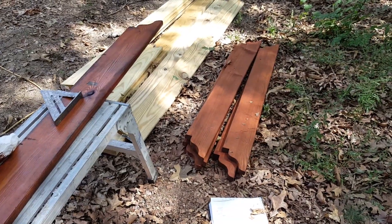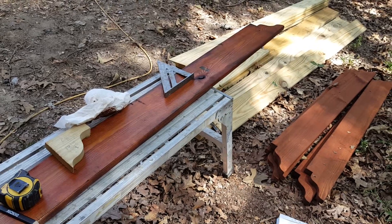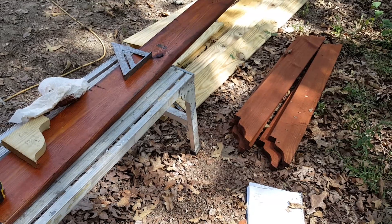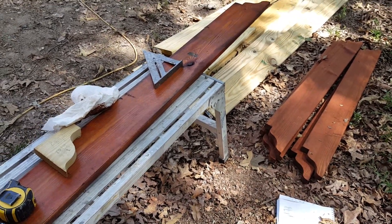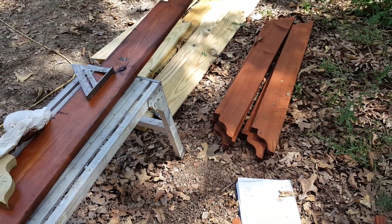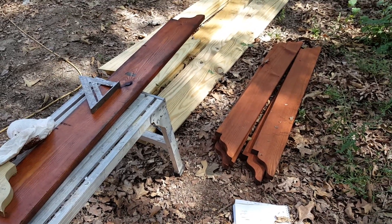By making those notches in both pieces, there will be an insert of about three inches that helps maintain those boards nice and straight. You can actually put some screws in it and it will snug everything together really well — much tighter than just sitting on top of the post or boards. This also works for the thicker boards like the two-by pieces.